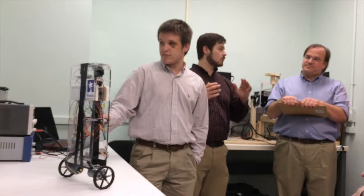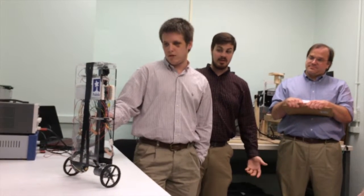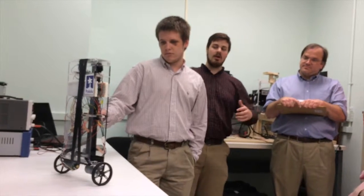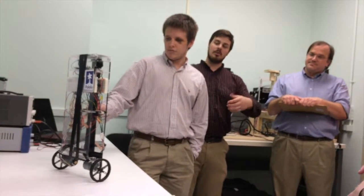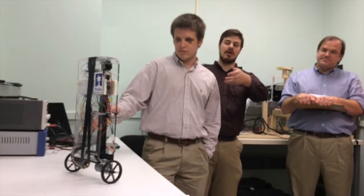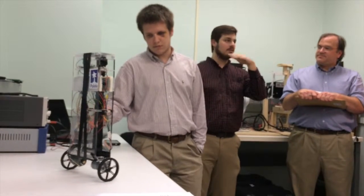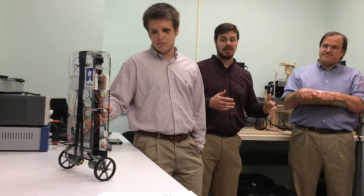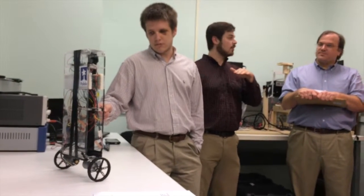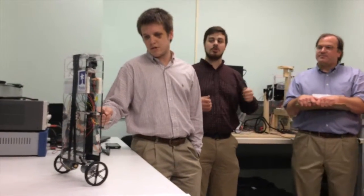We went with a really simplistic design, and one of the reasons we did that was it's really easy to construct and really simple, so we didn't have to worry about rough hardware and anything like that being near the electronics. And as time went on, a few key changes we made: the accelerometer we had on the bottom, really close to the motors, was getting some vibration from that, so we moved it up towards the center of gravity and put tape underneath it to keep it really stable, so it was not shaking at all from the motors or screws or anything. It gave us much better readings. The IR sensor on there is also a small, sleek design.